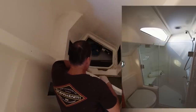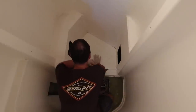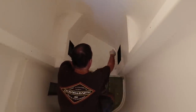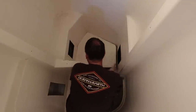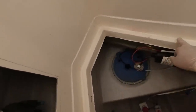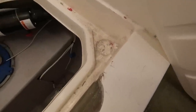It could create a little bit of a problem going forward, but we'll get it made and sand the outside edges. It's a perfect fit - the only problem is I want water to drain down the outside, so I think I might be doing a little bit of sanding around the outside once Janet finishes backing it with foam. All I really needed to know was how it was going to fit around the drain here. This is a drain and it comes down to a floor drain - it'll have a 50 mm stainless steel drain, so all the water has to go to that spot.